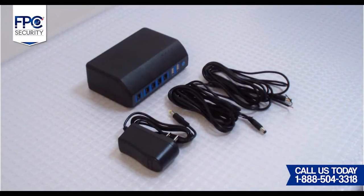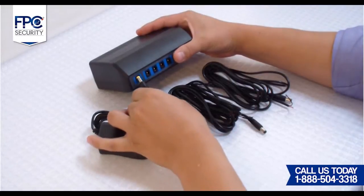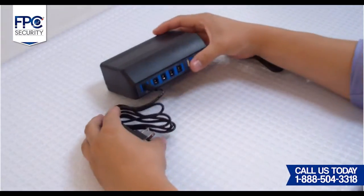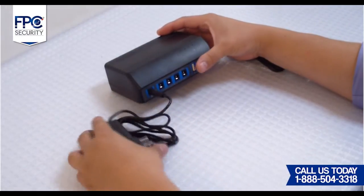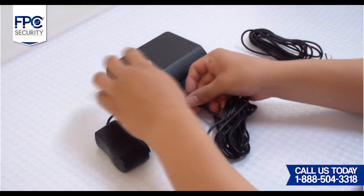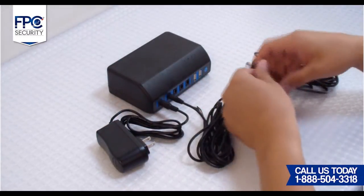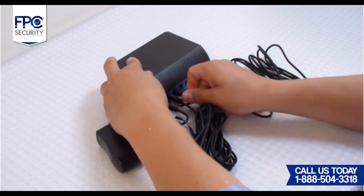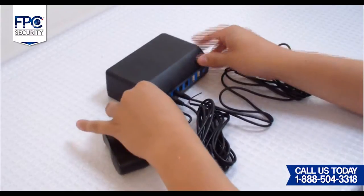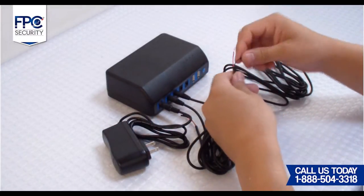This kit brings a battery backup that includes 4 DC cables. For this kit, we will be using only the 2 cables that have the connectors cut off. The other 2 DC cables with connectors on the end can be used for other devices. Keep in mind that this battery backup can withstand 1000 milliamps. This entire kit will use a total of 519 milliamps, so you will be able to use the remaining 481 milliamps for other devices.